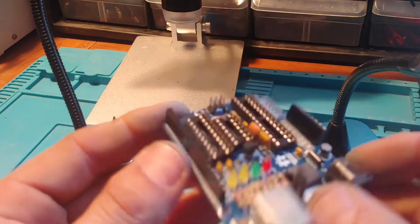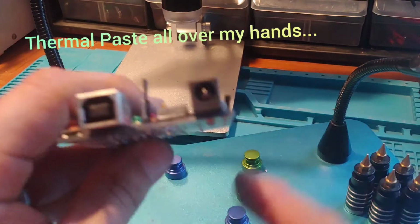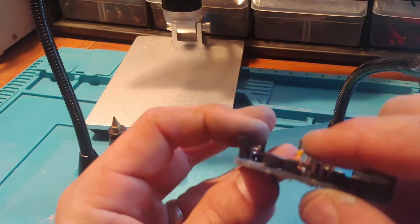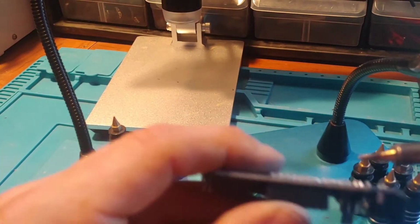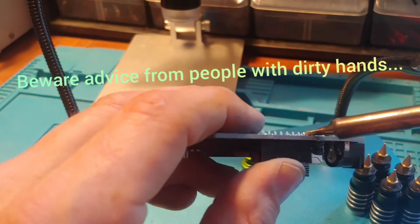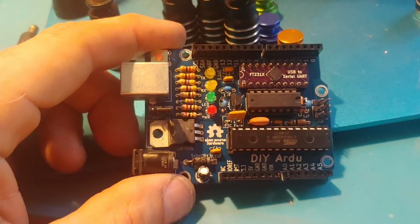One quick tip for the sockets and the headers and that, if you're not used to doing this kind of soldering, is to just put, you can see how this one is off angle. So to start out with, just put it in, get any one corner attached, and then once one is attached, you can straighten it up so that, once it's held in place, then you can loosen up the joint and get it to where you want it. So that's square. And that's it.